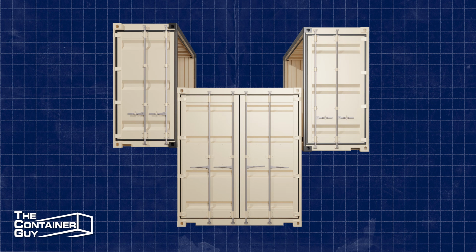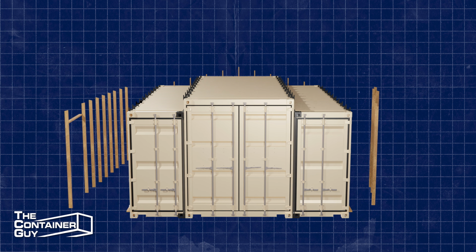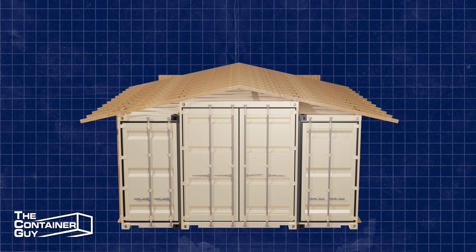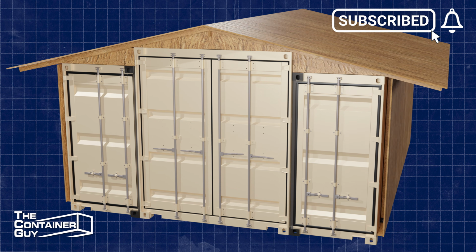We noticed there's a ton of traction with our new exterior studding brackets. This system allows you to stud the exterior of a container, and we've matched that with our method of cutting a standard height shipping container in half, taking each half and putting it on the sides of a high cube to give us a 3:12 pitched roof.